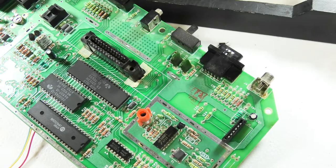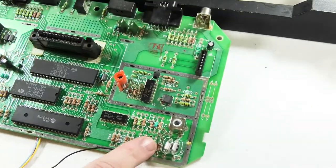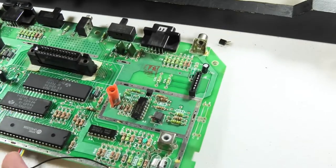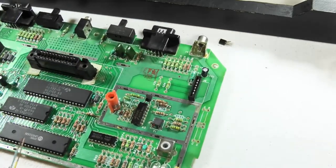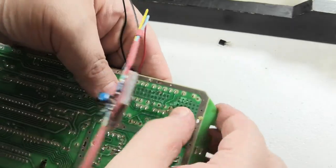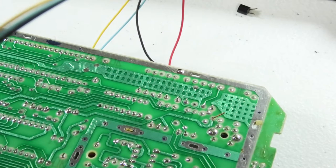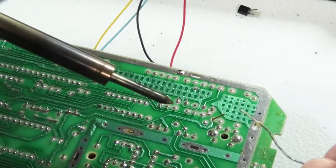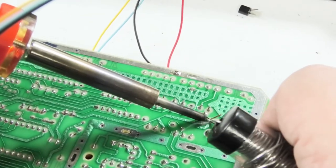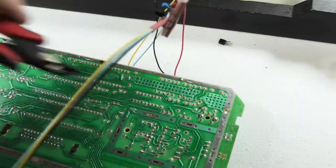The 5 volt goes right here — so my 5 volt is the red wire. I bend it slightly so it doesn't fall back out, then solder that in. Heat up the part, bring the solder in, then snip off the rest.